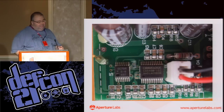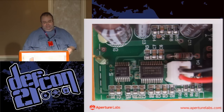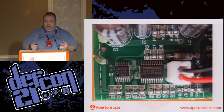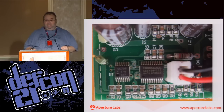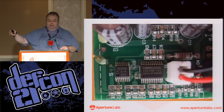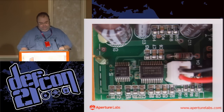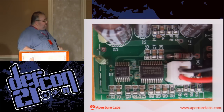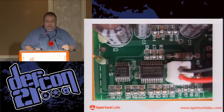And then we've got the OC706, or if you look at the other plug, it's the OC708. Can't find anything about this device. Now, when you read the Cirrus Logic data sheet, this is a current to frequency converter chip. So it's measuring the current across that resistor and it's outputting a frequency that's proportional to the current consumed. And it needs a clock as well. And when you reverse the circuit, this OC706 chip is supplying the clock to the Cirrus Logic chip.